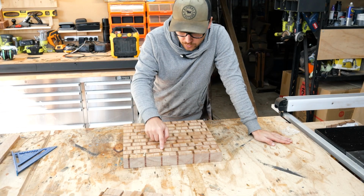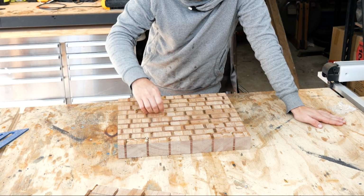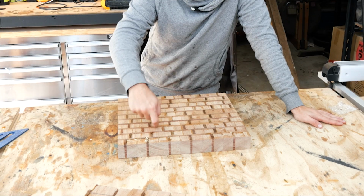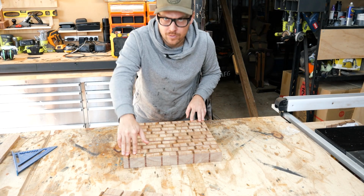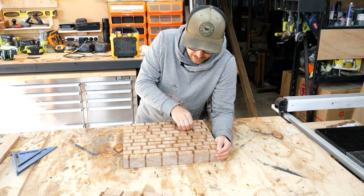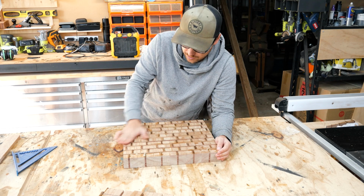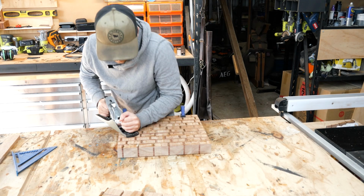We have to clean up all of the black wood here because that's obviously a little higher. You can see that there are lips all around here. And I was thinking about how to do that. This is already absolutely flat because of those panel clamps, which is awesome. So I only need to remove those high spots. Maybe do it with a hand tool, like a hand plane, and see how that works.